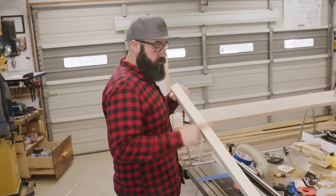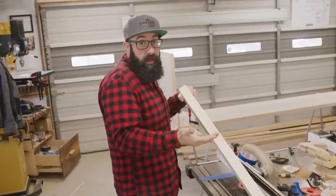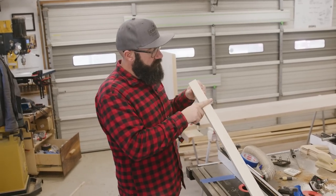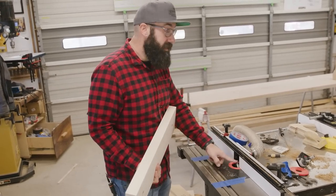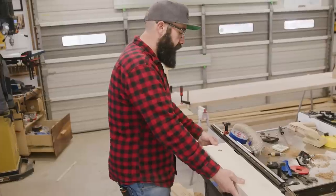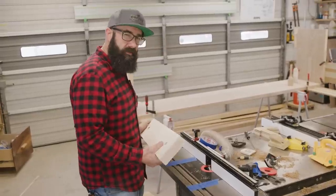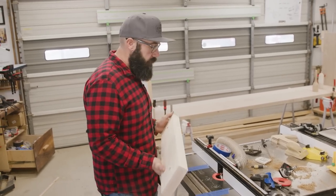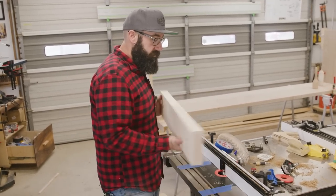We're going to be adding a heavy chamfer on the front face of the movable jaw. That is going to be for if I ever decide to do half blind dovetails, which I probably may. The point is I want to have this chamfer start six inches from this side and six inches from this side. So I measured six inches over from both sides of the middle of the bit, and I can run this along here and stop it at that line. I'm going to take two or three passes because I don't want to take out the full depth of this chamfer right out of the gate — I could have tear out or chipping. So I'm going to fire this up and get this chamfer going.